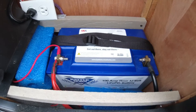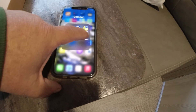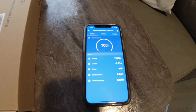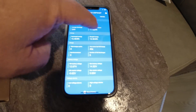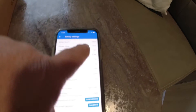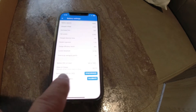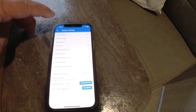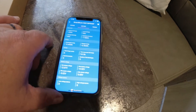I've turned on my Victron controller and this time instead of monitoring the charge, it's monitoring my shunt that's actually up by the battery. You've got 100%. In the settings under the battery I made sure it's still set at 100 amp hours, and I went ahead and hit Synchronize because I knew my battery was at 100%. That makes sure it tops it off and tells the system exactly that your battery is at 100%, so it has a reference point to go from.